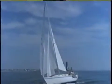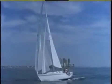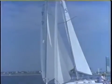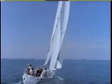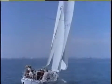The staysail must create an even slot between the main and jib top, so it should lead inboard when the main and jib top are well inboard, then move outboard as the wind fares and the jib top and main can be eased. The double head rig can also be the best combination for heavy air reaching at wider wind angles. It should be used when it's too windy to carry a chute in the 70 to 100 degree range.